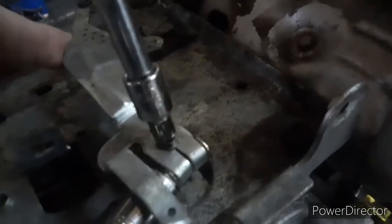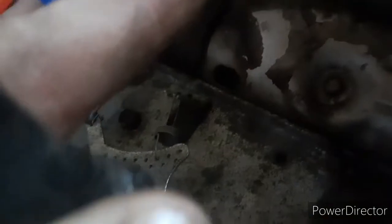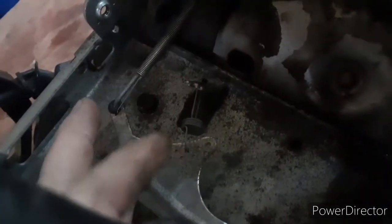Now to set it — it's kind of awkward, but you take the carburetor, make sure it's on full throttle, and push this arm over. A spring — if you tighten up the spring it'll do the same thing, but I'm just using my fingers. You take a 3/16 socket, put it on the head. It doesn't take much force, but you turn it clockwise to where it bottoms out on the other side — that's the governor assembly on the internal side. You want that bar to push in there. That's why you have the 3/16 on that governor shaft pushing against that governor. Now that's full throttle — you torque this one down here and you should be all set. The spring goes to the fifth hole, but you could have more throttle response by moving it up a few other holes.